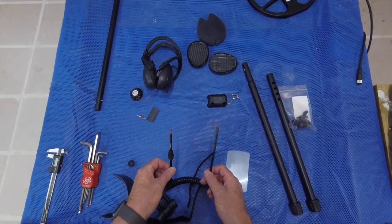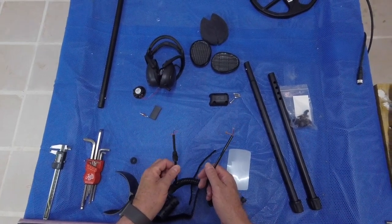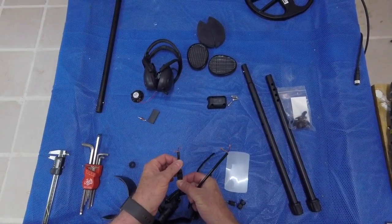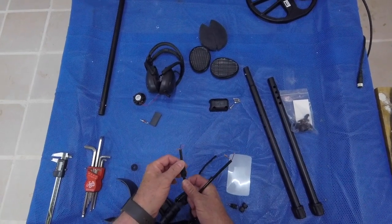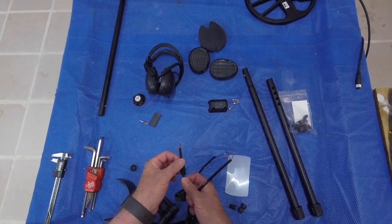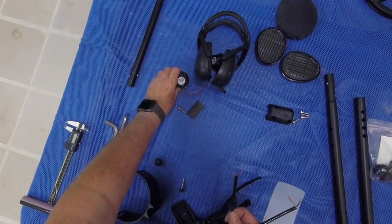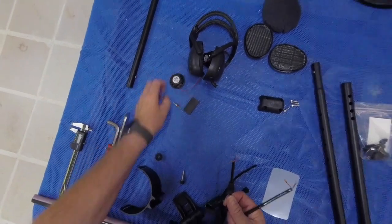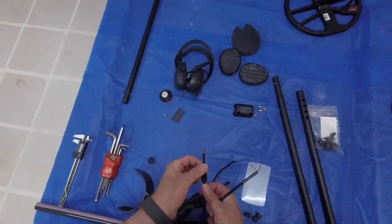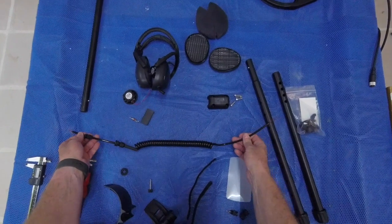The only thing I do need to sort out is have a quick look at the wiring. People have told me that the unit checks for headphones and blanks the speaker if it detects headphones. I think there is actually a little bit more going on there, in that it checks the impedance, and if you've got low impedance headphones, 8 ohm or something like that, it will blank the speaker. But I've got a higher impedance, in this case 50 ohms on these waterproof speakers, so it might not. I was going to wire them in parallel rather than in series. Again, that was a recommendation of the internet. So a few jobs there to do.